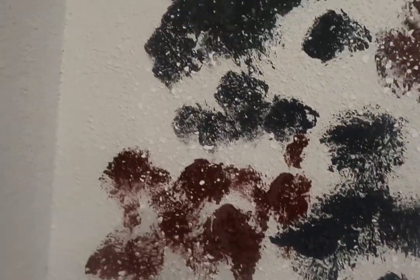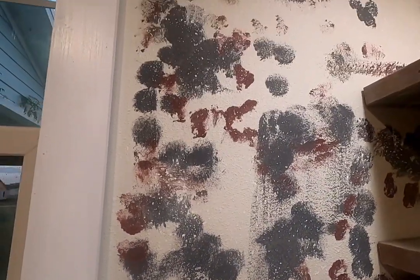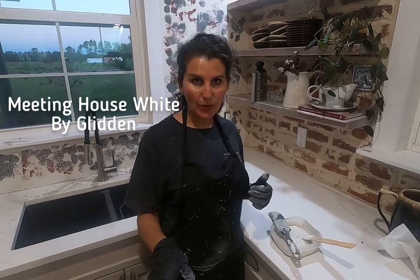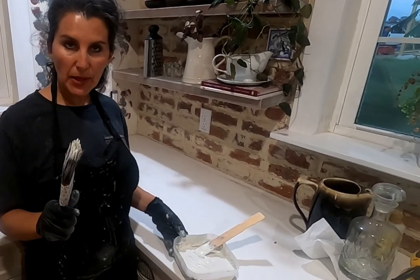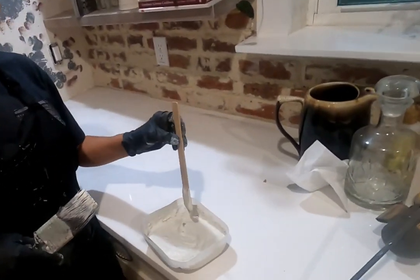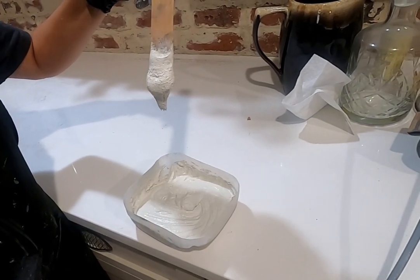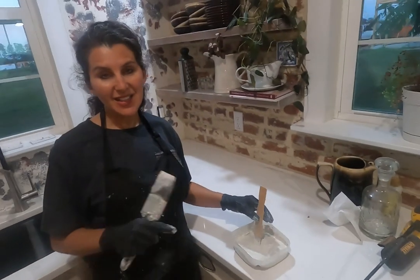On the top coat, instead of exposing the white it's going to expose the under colors very minimally, and that is going to create the stone wall look. I've now made my batch of the off-white top coat — it's called Meeting House White by Glidden, the color we have in our kitchen originally. I made it a lot thicker than the first batch by adding a lot more salt wash. Just look at this gooey consistency — it pretty much holds on the stir stick. I think that will work a lot better.